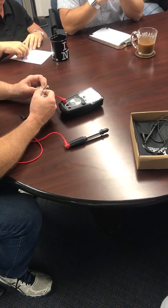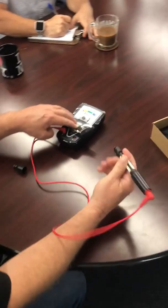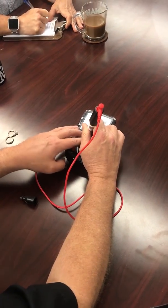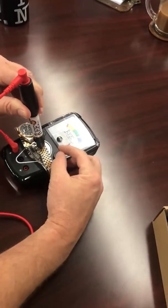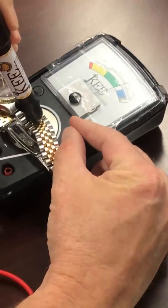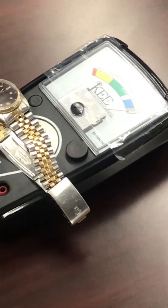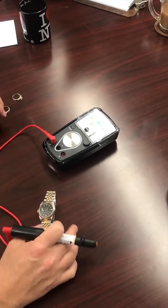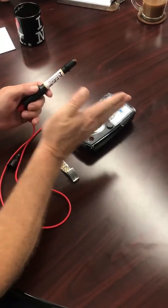Find a piece of known 18-karat gold — this band — and press it on here. There's a new pin so it's not going to read 18 yet, so you dial it in with this little dial, into the middle of 18. Now you're ready to test. You set the calibration to tell it 'this is 18,' now it's calibrated and knows, and it's ready to go.